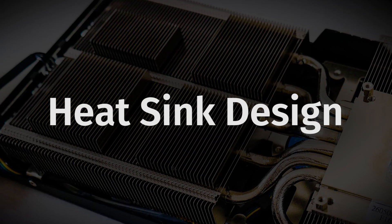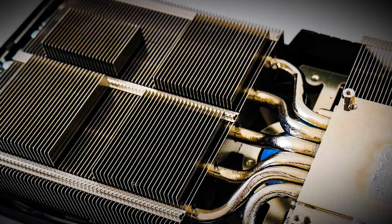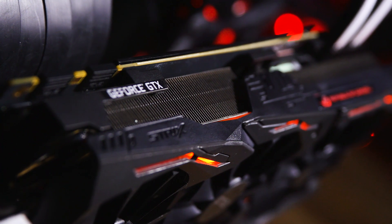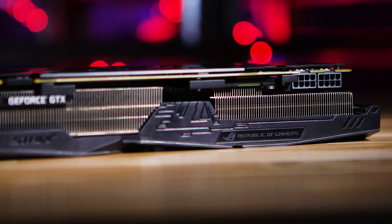The heatsink design on this card is 40% larger than what we use on the GTX 1080 Ti and 80% larger than what you have on the Founders Edition — a huge, monstrous, beefy heatsink. It has six nickel-plated heat pipes, which look great and minimize oxidation. They work in conjunction with a brand new industry-first MaxContact plate design using advanced machining and finishing to deliver an ultra-lapped surface for outstanding conduction efficiency between the heatsink base plate and the GPU. In most situations, you can easily see temperature reductions in the range of about 15 to as much as 20 degrees cooler than the Founders Edition.